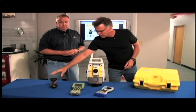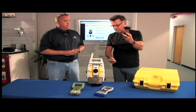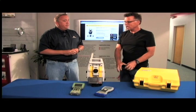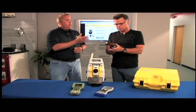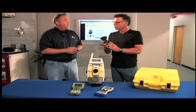You always have to hit the target, and that's what a lot of people worry about. If you're doing a one-man operation, holding the pole and doing data collection, and suddenly a big earth mover comes between you and the machine and you lose signal — do you have to put everything down, go reactivate, try to recalibrate? No need at all. It will reacquire the prism automatically. However, if you're unable to reacquire it on the fly, it's a simple one-button operation that will search and reacquire the prism.